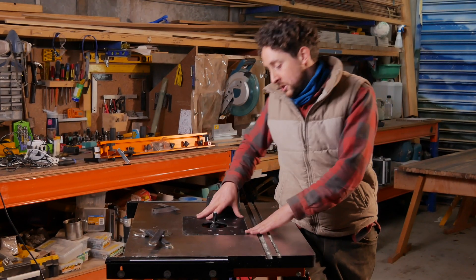The reason you'd move into a system like this is it's going to save you time — granted, it's not a ton of time to wind up and down, but it is time you're moving between operations. It's more accurate with less test cutting, and that's what I'm really excited about. If you've watched any of these videos, you know that I'll test a depth usually two or three times before I'm 100% set. Having the ability to move down two tenths of a millimetre and know that's where it's going to be is a huge advantage in my shop, because that's really hard to measure without a caliper — and even then it's not always correct.